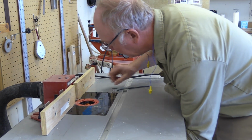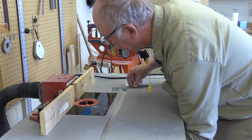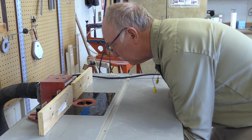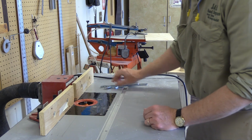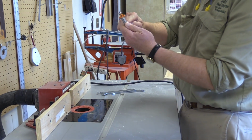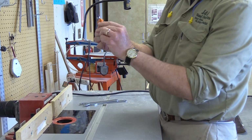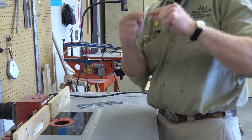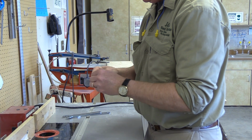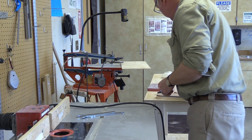So I've loosened it up on the first notch, spinning it up to the snap ring. Now I'm going to loosen it up for the second one. There that goes. Now it's loose. So this is a half-inch shank with a 1/4 round over. You could put a fingernail. You just drop it down a little bit further. It's called a fingernail, kind of like the end where your fingernail is. You can make a little fingernail on things, and sometimes that's a little decorative thing.